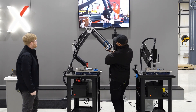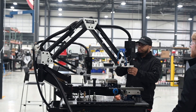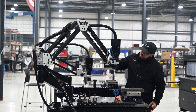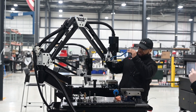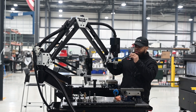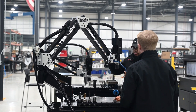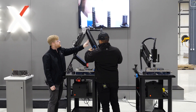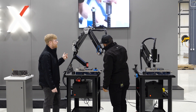That's about 70 inches of reach, from the angle all the way to the end of the tapping head. 360-degree rotation, so you can spin it around if you needed to, take it to larger parts. And there's a built-in semi-tap lubricating system. There's a reservoir right here that you can remove, fill up with lubricant, hook it up to air, and now you can mist your tap as you're going down.